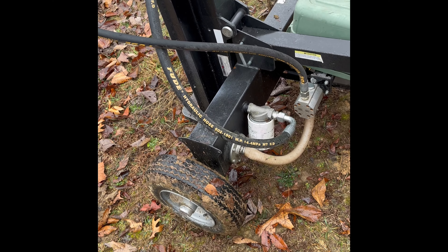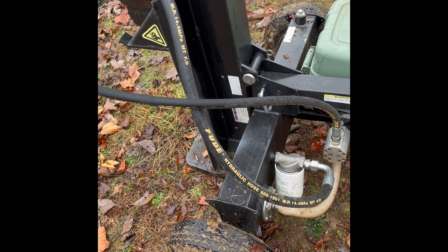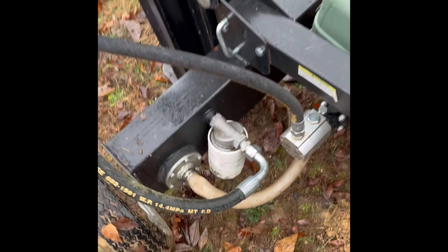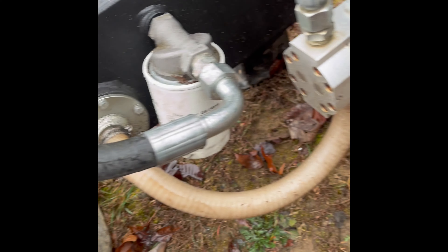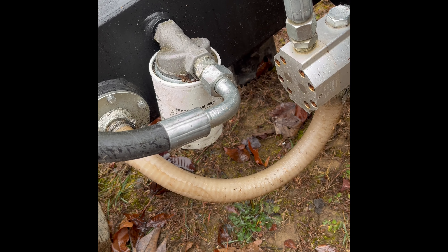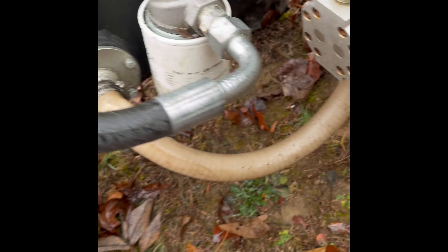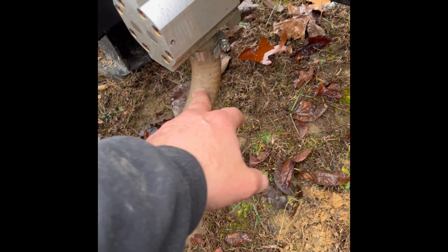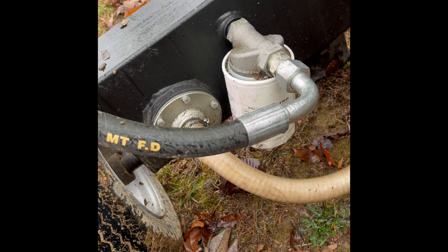I want to be realistic about this wood splitter. It has made my life tremendously easier and better. But there are a few flaws on this particular brand that I didn't really care for. One — the reservoir where your oil is stored, see there's the venting cap. Whether it's condensation or whether the venting cap leaks, moisture gets in the oil the very first year that I had it. You can see this is a clear hose — you can see the milk in it, and that is terrible on these pumps, because where there's water and heat, there's no lubrication.